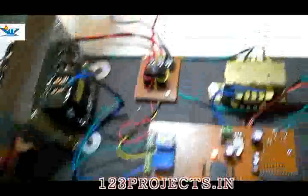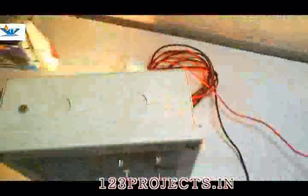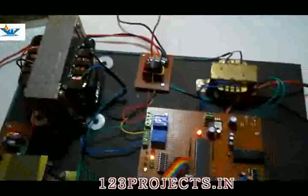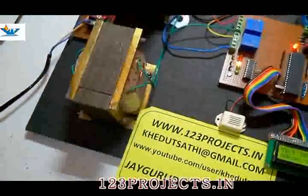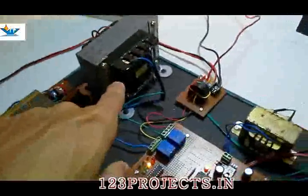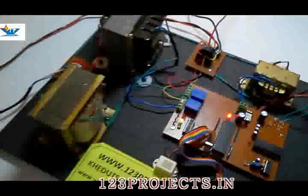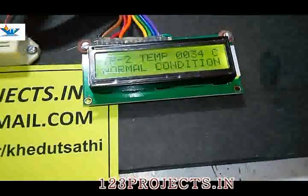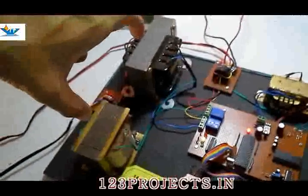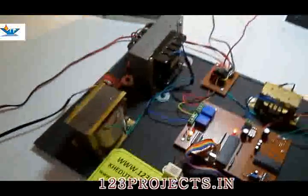So now the power supply to this distribution line, the single bulb holder, which demonstrates a low side distribution line, is driven by this reserve transformer, and the more power-consuming load bank is driven by this big transformer whose capacity is 400 watt. So now the total consumption is 200 plus 200, which means 400, plus 100, which means 500 watts. So it is greater than 400, but it is in the range of both of these distribution transformers, the total capacity of this system.